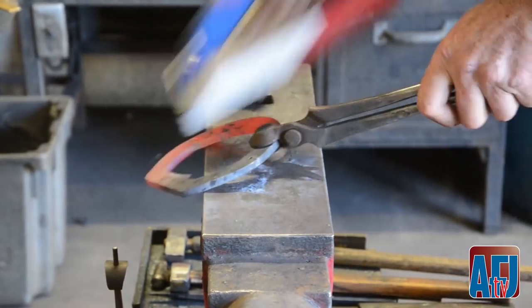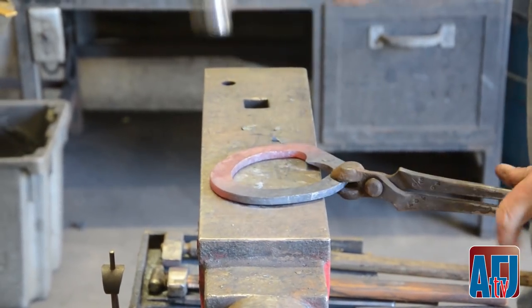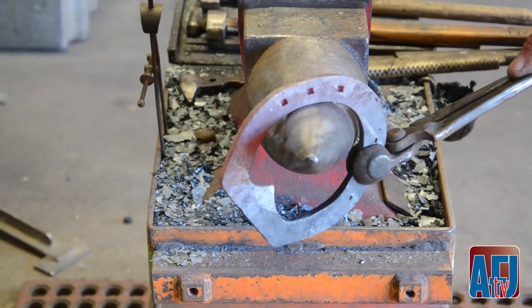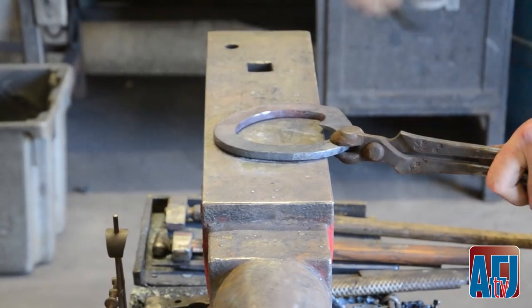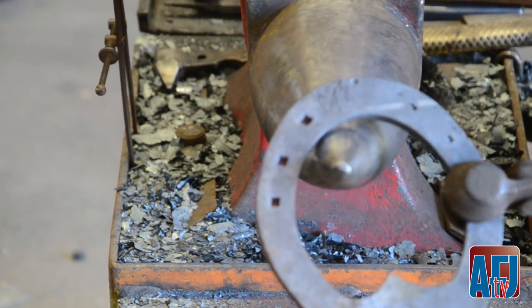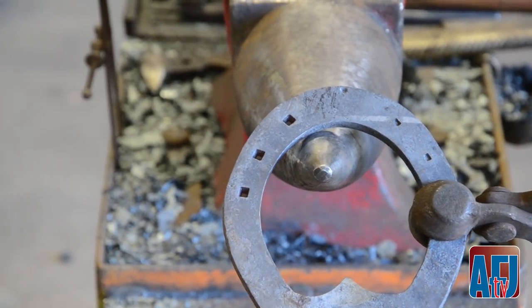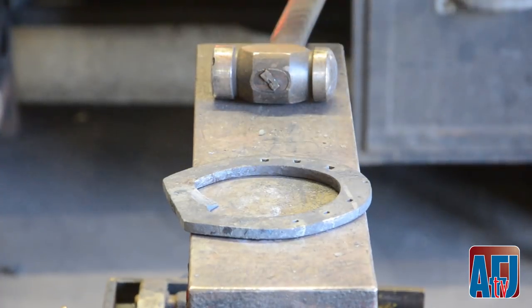Don't go all the way down because you've got a little bit of forging. What you're doing is that initial burst of putting those nails in is to displace material. What I did is move material. So now I'm going to run over and out in blows, and now I'm forging. What this does is it makes our nail holes hourglass shape. Every nail hole slightly puckers in, almost like an hourglass shape. But we have that initial blow of displacing material, so now I can come back and finish that up without fighting the frog eyes on the edge of material.